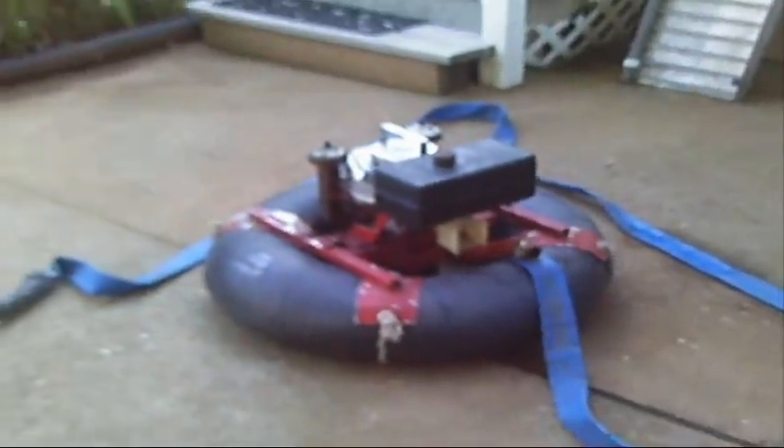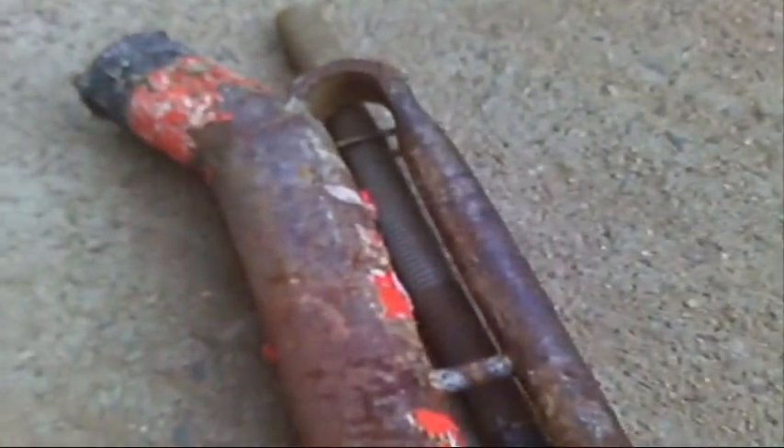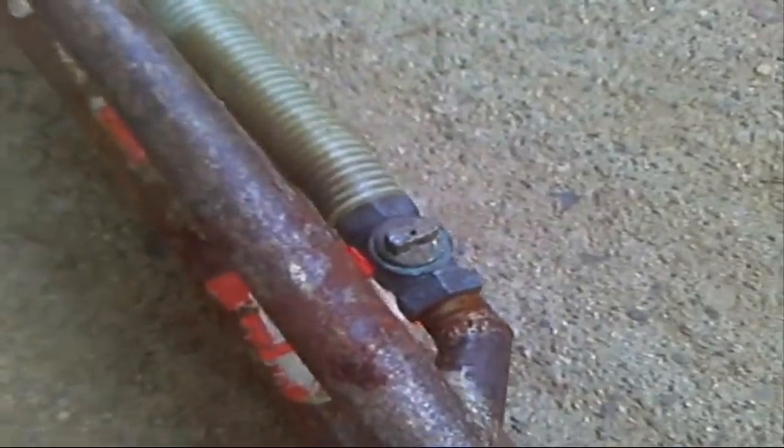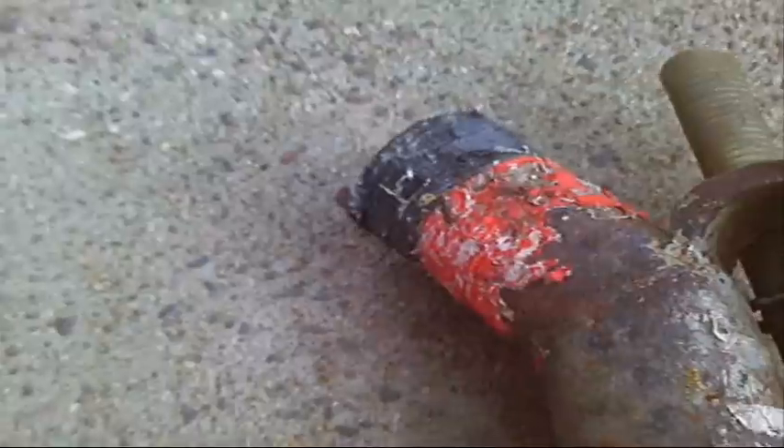What you do is set your pump in the stream, take your 50-foot hose, nozzle, and sluice up on the bank — this allows you to dredge on the bank, no shovel required. You turn on the valve and it pumps water right to your tip. That gets a little hole started, you get a puddle going, then keep working it bigger and bigger and start dredging — 50 feet up on the bank.